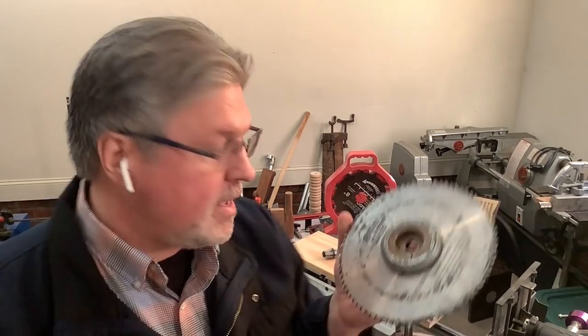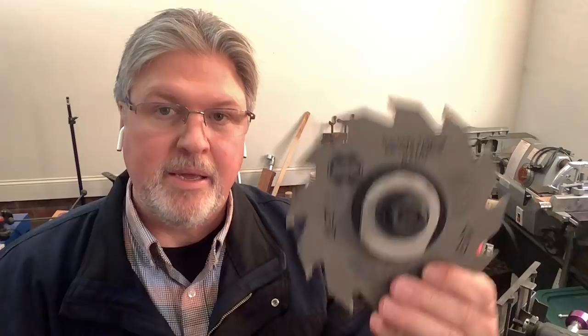If you're going to run a 6-inch blade, which is what's typically used by DIYers these days, you run this at table saw speed. If at any point you're dadoing, cutting a groove, a rabbet, and you feel like it's bogging down, you will actually be able to increase the torque by slowing the speed dial down just a bit.